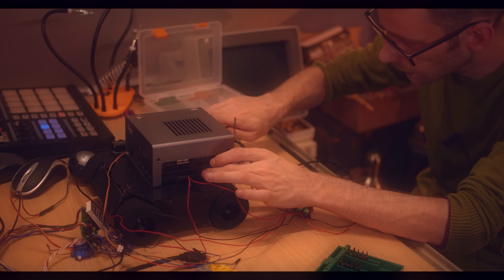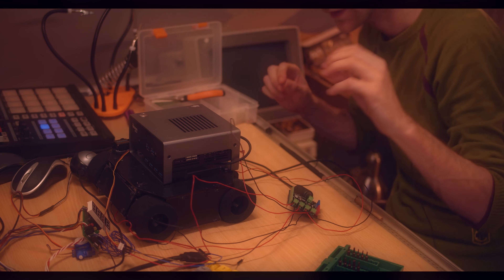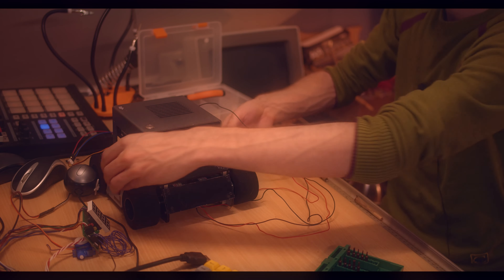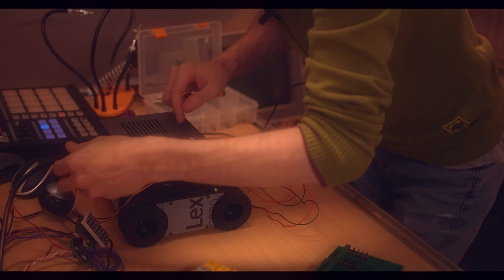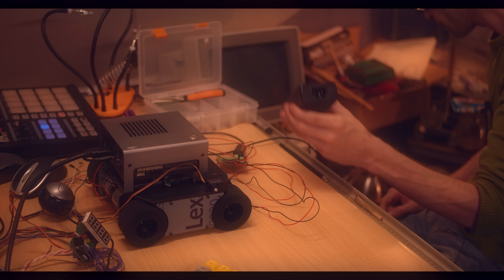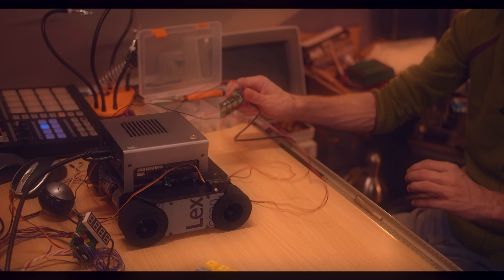So what am I doing here? Oh yeah, we were doing the motors. Take your motor controller, then take the front left wheel and a screwdriver. This will be marked motor one, motor two, motor three, motor four. The black one goes to minus. So now my front left wheel will be motor one. This is something you need to keep in mind for once we start writing the code. We know how to address the motors individually and make them drive — you'll be able to assign a direction and a speed to them, so forwards and backwards at a given speed. This is just very simple actually.